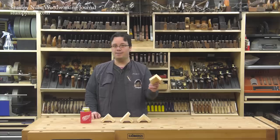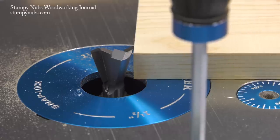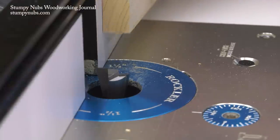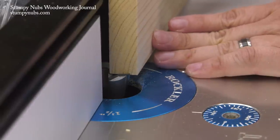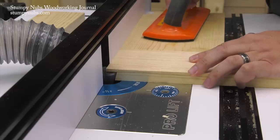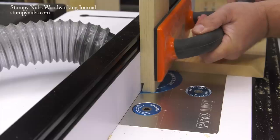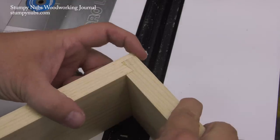A dovetail rabbet isn't stronger than a standard rabbet but it sure looks fancier. To cut this joint, I'm using a three-quarter-inch wide dovetail bit with a height set to about two-thirds the thickness of my workpiece. The fence setting is more critical — it must be set so the bit cuts equally as wide as it does high. I recommend eyeballing it first, then cutting a pair of scraps: one flat on the table, the other on end using push blocks to keep them both stable as you cut. Make adjustments to the fence position and re-cut both halves until the joint is nice and flush.